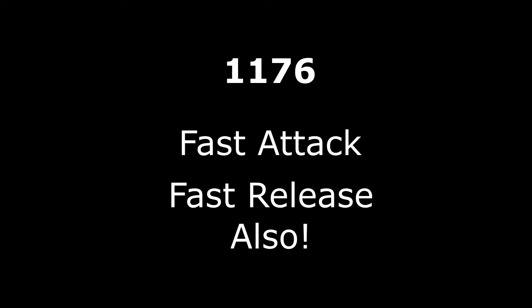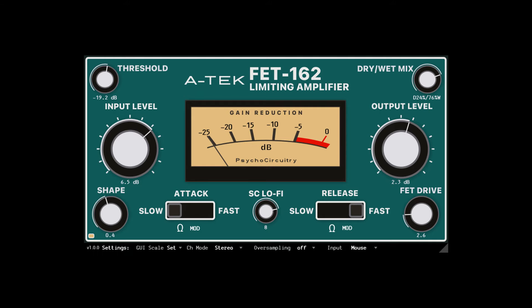So then we should also consider the timings. A more versatile, initially designed unit like the 1176 has attack times that are plenty fast to medium length, to emphasize the compressor's behavior. In a design more strictly focused on limiting, the FET's fast attack response would also be useful, but accompanied with a slower release time to maintain transparency and prevent more overs.